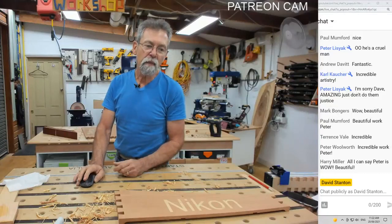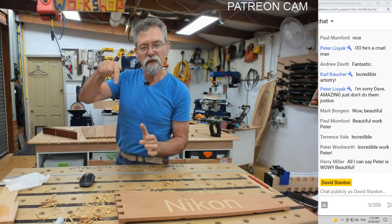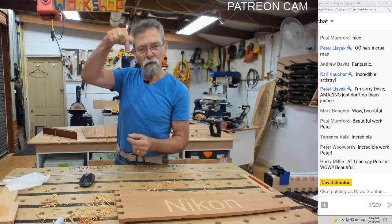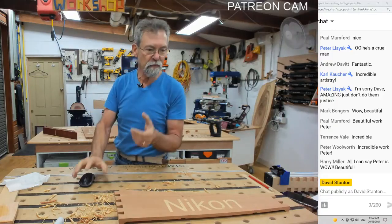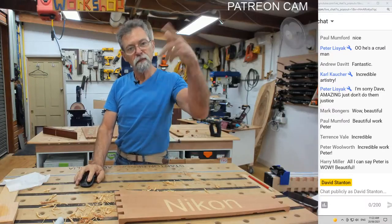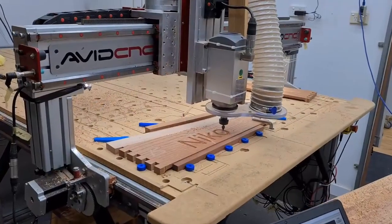And then from there, the clearance tool, because the actual V cutter, I used a 60 degree V cutter. If you were to do all your clearance with that, it's only got a really, really tiny point, so it'll be there for a month of Sundays doing all that clearance. That's why you use a larger tool to clear out everything in the bottom. So this is the 60 degree cutter, and I did it in two steps. And there's a reason for that. I don't want to break the small tool. So here we go with the first run.